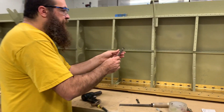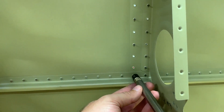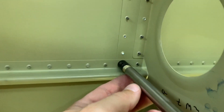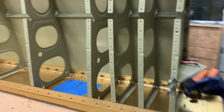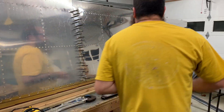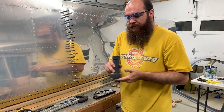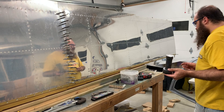So if we come up here real quick, you'll notice on this overlap — what I would do is push down on it until it touches the shop side of the rivet. And then on the other side, we would use a big back rivet bucking bar.